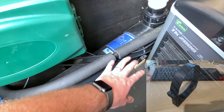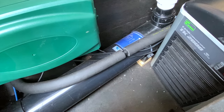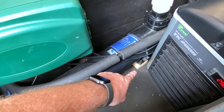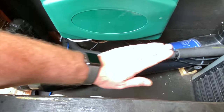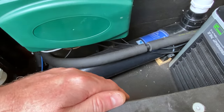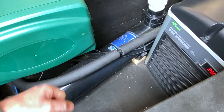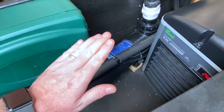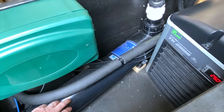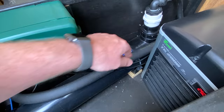As you can see, I haven't fixed the clamp in place yet — it's been there a couple of weeks while I make sure the UV is sitting exactly where I want it. I have it sitting up on a little wood and a spacer at the outlet end so I've got a nice little angle there. I recommend using a level app on your phone to make sure you have at least a good few degrees of rise so any bubbles won't sit in the UV body causing hot spots — they'll get flushed out and keep moving.